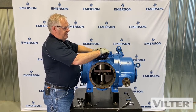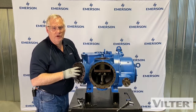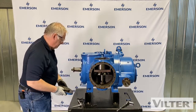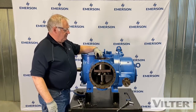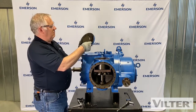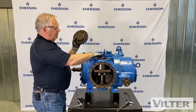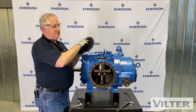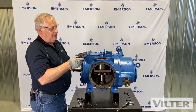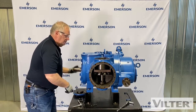Once you lift that off, the cover comes out — there's an O-ring that sits in there. We have removed it on this machine just to make it easier for disassembly, but there is an O-ring that goes in there. What do I find on the top here? I have these shims that we talked about — they sit in here. Here are the inner holes that were held by those set bolts, and there are the shims. It's going to pull this bearing housing up tight against that. So those shims determine our shelf clearance. Keep those together per side and reassemble with the same shims — it'll give you the correct shelf clearance.